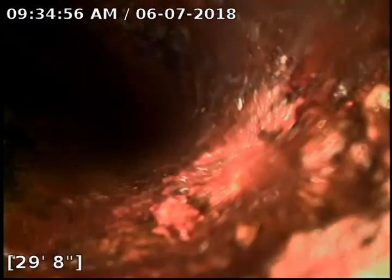All right, so now we're going through the other clean out, the one that we just ran to from the street up towards the house. And we're traveling towards the house underneath the pool deck. All this is PVC. We got a little bit of a dip there, a little bit of a belly in the PVC. I'm gonna stop and locate that on the way back.